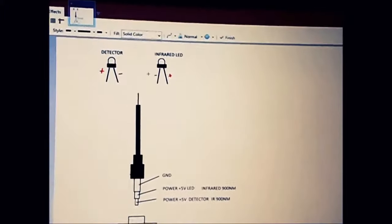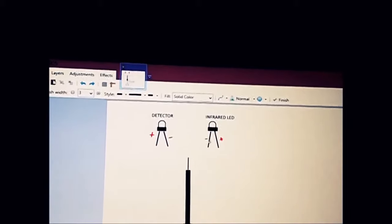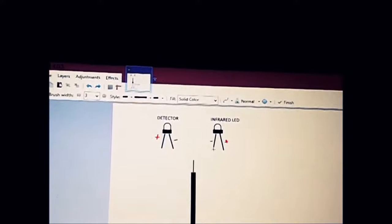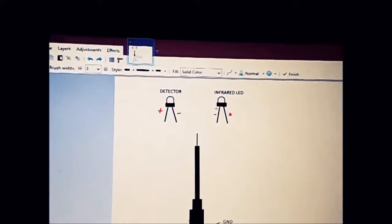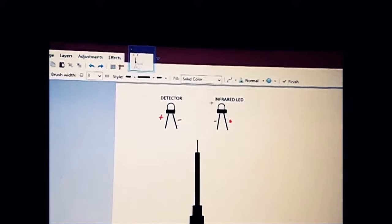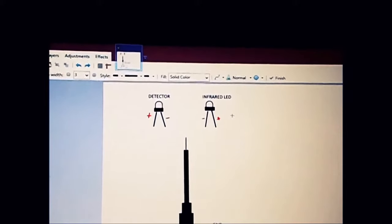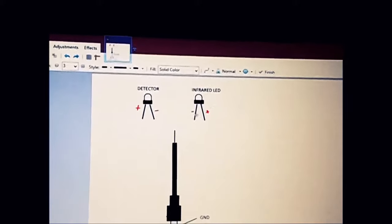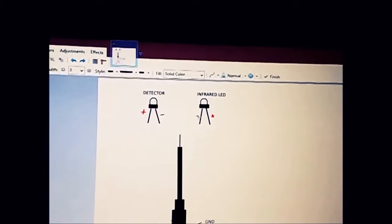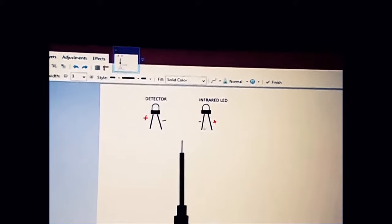So let's get back now to how we need to connect our LED. First, for the LED, you can use your multimeter and connect the black one to, let's say, this wire, which is minus here, and the red one here. And if you get your LED to actually show you a little bit of light, then you have that connection right. If you don't, swap it, simple as. So you want your negative to be on this side and positive on this side in this example.